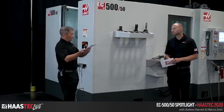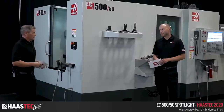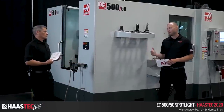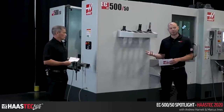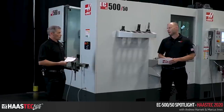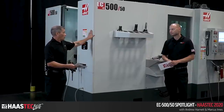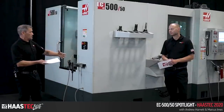We have the same kind of design improvements — the step column and that sort of thing for more rigidity. A lot of the base is actually the same between all three machines: the step column, the improved ribs and casting, and the proven 50 taper spindle design from our other machines, all integrated. Part of the reason we kept it compact is to achieve one of the smallest footprint 50 taper HMC's out there.